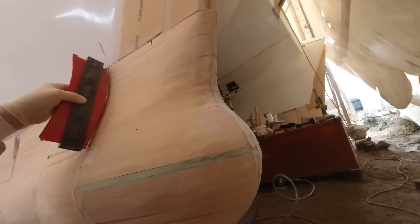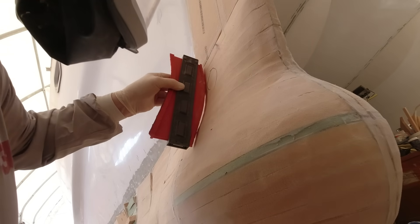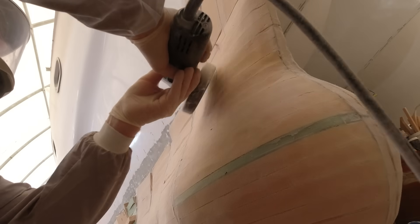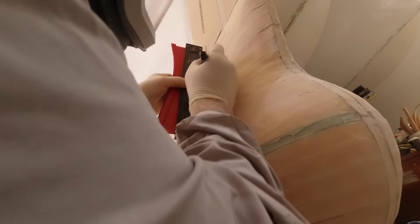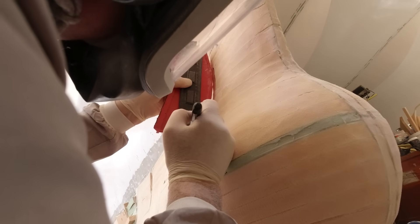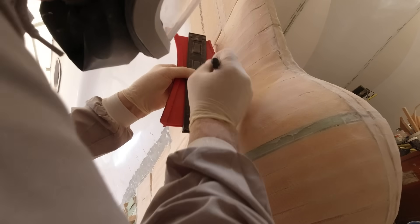As you can see, I'm using a very, very light approach with the flap disc. It then went on to a torture board and sanding disc and then an orbital just to basically take it down and make it smooth. You can see here where the gaps in the actual shape jig allowed me to pinpoint those sections, and then by using a straight edge — which you'll see later on in the video — to take those areas down to make sure it's consistent all the way along.